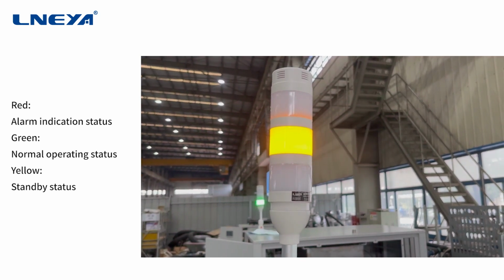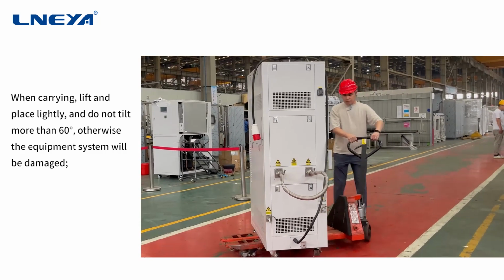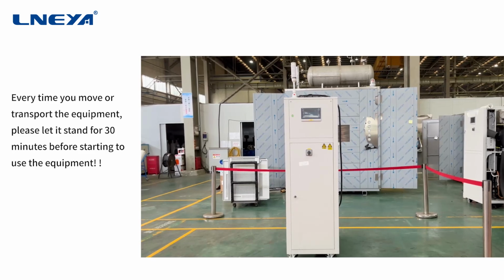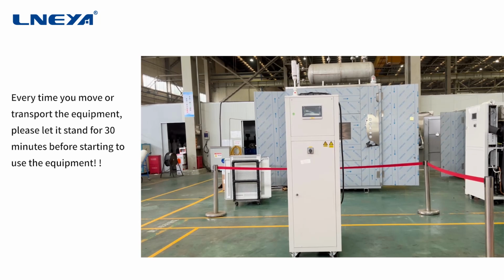Yellow, standby status. When carrying, lift and place lightly, and do not tilt more than 60 degrees, otherwise the equipment system will be damaged. Special reminder: every time you move or transport the equipment, please let it stand for 30 minutes before starting to use the equipment.